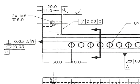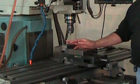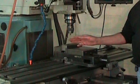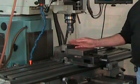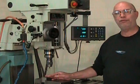So obviously, if I pre-drilled these 9mm holes on the full length of this pocket, well, I'd be getting myself into trouble, and my part wouldn't be any good. So what I'm going to do is drill a series of holes, but I'm going to restrict my end holes to the coordinates that I used for my 3/4 inch end mill, and that'll keep those 9mm holes well away from the end of the part, and everything will work out just fine.